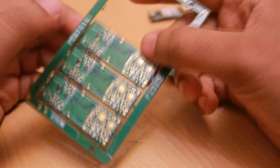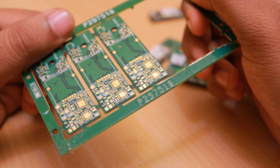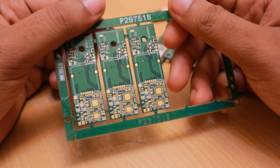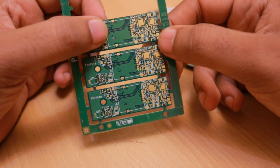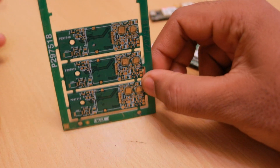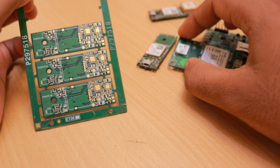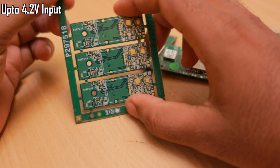This was the reason I had to change this chip, because it was always giving me 4.34, 4.4 volts, sometimes 4.5 to 4.6 volts, which was creating problems for my circuit. So this was the first mistake I made. Be careful when you are using TI battery chargers because they don't have internal regulation and there is no option to set the regulated output voltage. If you are using any of the TI BQ series charger chipsets in your design for GSM applications, please reconsider your design because this chip will give an output voltage out of range for your GSM modules — even TELIT GSM modules will not work. The maximum output voltage GSM modules can safely take is up to 4.2 volts.